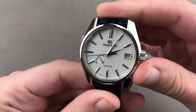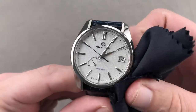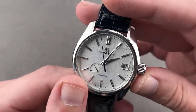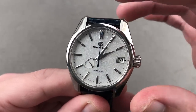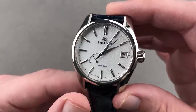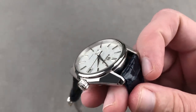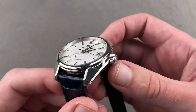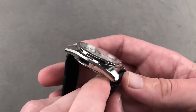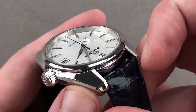As we draw towards our conclusion, you don't have to go crazy to own one of the ultimate craft achievements of Grand Seiko. This is part of the limited edition of Kira Zuri dials — or shiny painting — an artisanal craft emulated by the rusticated and metallic-coated dials of the SBGA385, 386, and 387. This is the 20-piece SBGA385 — the most exotic, accurate, and exclusive of the three Kira Zuri models. The 44GS case has been around since the late 1960s with a lovely combination of curves and flat planes, hard angles and arcs. The facets — especially the upper and lower facets of the case — are black polished. Executing that Zaratsu finish on precious metal is no mean feat; doing it on platinum is harder still. It takes three years to master this tin-plate black polishing that Grand Seiko uses on its cases.